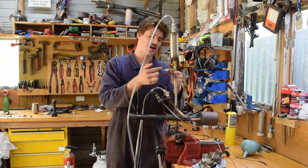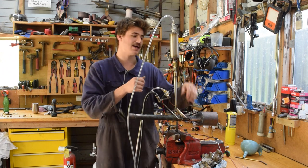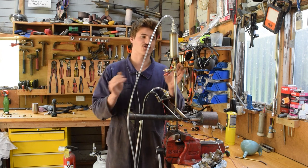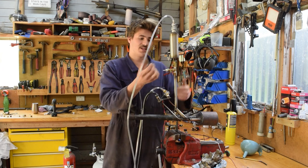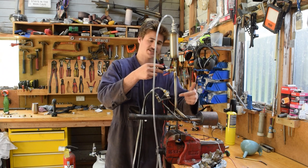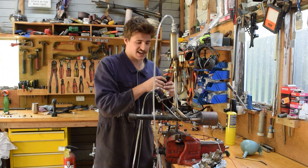So then I tried adding diesel in through the side here, which would pressurize everything with the flow of air. Then you could just drip your diesel on top, add into the airflow, much finer control. We don't have a pressurized tank of diesel. Didn't work, it hydrolocked. So then we vented air to the top and then had a regulator through the airflow through the system, which meant we had a pressure differential. Again, you're getting the idea, didn't work.